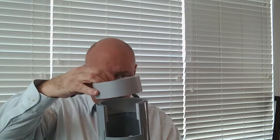This concrete junction box is a simple slab-on-grade. It's going to be installed, the concrete will be poured, and when it's leveled and dried, the contractor will trim this to the level of the concrete finished floor. You can see here that I've done a cutaway on this box. The only reason I've done this cutaway is to show you that once this box is cut, this sleeve is installed, and it's simply installed with PVC cement.